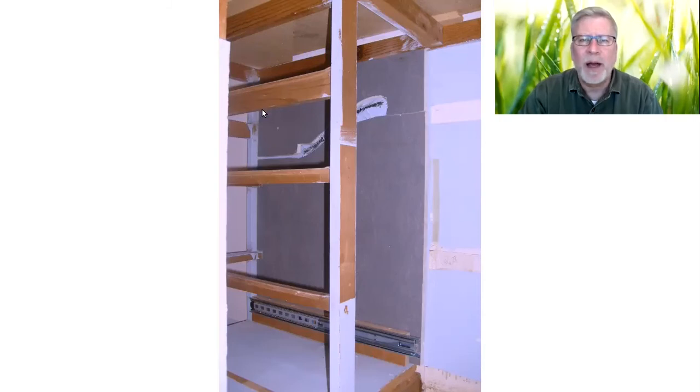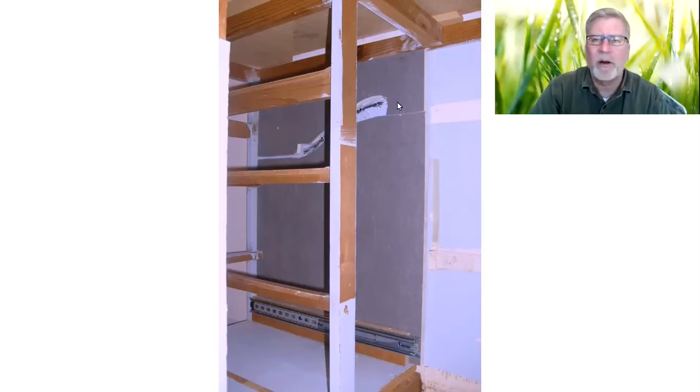In an effort to keep the water pipes from freezing, I put a piece of foam insulation on the wall here. There was a built-in oven on the wall and the stove top was separate, built into the countertop. This is real heavy gauge — like six gauge wire — that came out of the wall and ran across the inside of the cabinet to power that electric stove top. We had a window air conditioner in this kitchen for a while that ran on 220 volts. I came out of the wall here, jumped one stud, went back into the wall, and came up with an outlet for that window air conditioner. Not the best looking, but look where it is — you never see it.